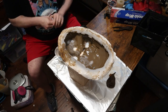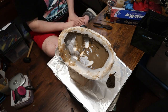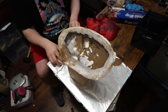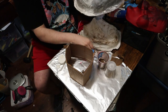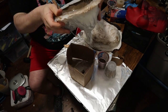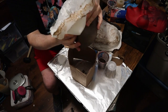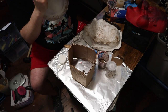Here's an interesting thing that happened — I mixed the resin wrong by just a little bit. One of the things that happens is it gets sort of greasy. When you have too much of the curing part and not enough resin, you get this really oily surface on it. The inside thankfully was the only thing that had that, but it requires a lot of cleanup and it's just nasty. This backup mask already had something go pretty wrong, but I cast it again — I just do it again when in doubt.